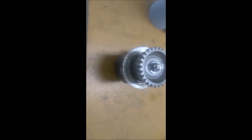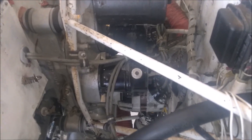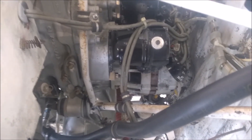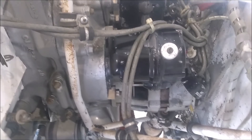I'm going to take this back to my office and make sure the rig pins go in and the buzz box checks out. Remember I said the right one was hard to get on, harder than the left side. I decided I'd put the left one on first because it's easier, but now I just made putting the right side on even harder - now it's hard to get to my mag over there with this one on. So hint: put your right mag on first and then put your left mag on.